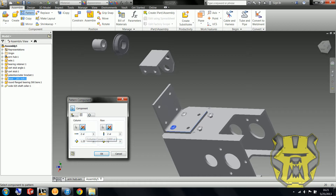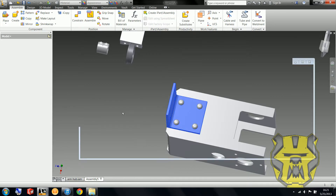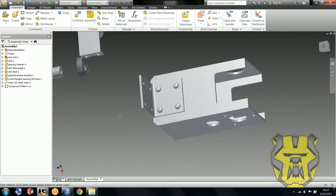Over here I'm going to guess at one and a quarter — not quite right — one and an eighth, looks like it's perfect. If you don't know, you can right-click, open the part, go to measure, center point to center point — there's one and a quarter, and here's one and an eighth. So don't guess; I just kind of already knew what they were. Guessing is not good when it comes to robots.